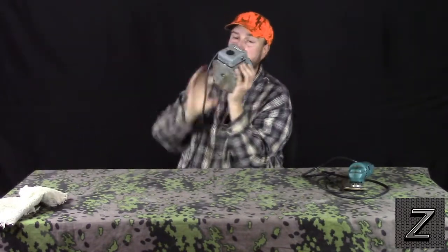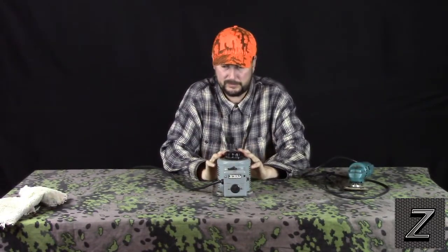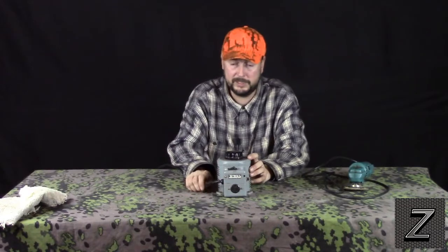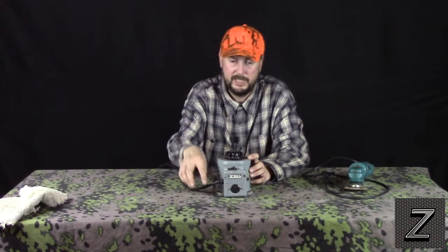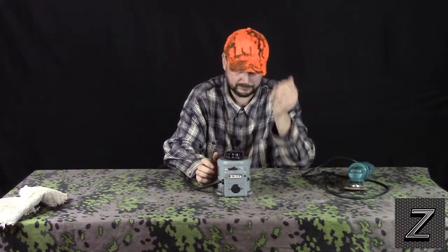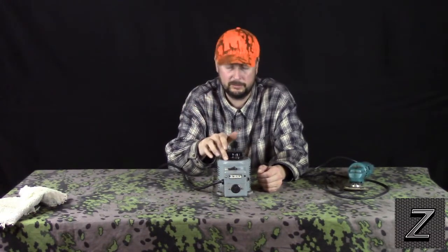Why don't we just take a look at it and get right to it — I'll plug this in and demonstrate it working. What we have is called a Variac. What this is, is a transformer that you plug in. I've got it plugged in down below here underneath the table. You plug it into your wall — your 110 — and then you plug in the item you want to control the speed of into its outlet. If it doesn't have a plug, it'll have terminals. This particular one has a plug. It can control the AC voltage from 140 down to 0 volts.